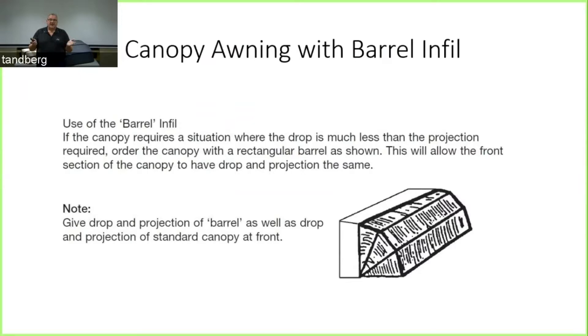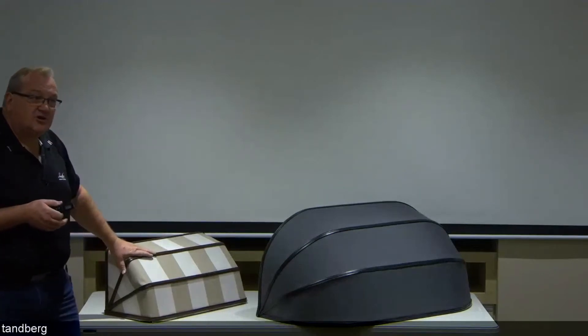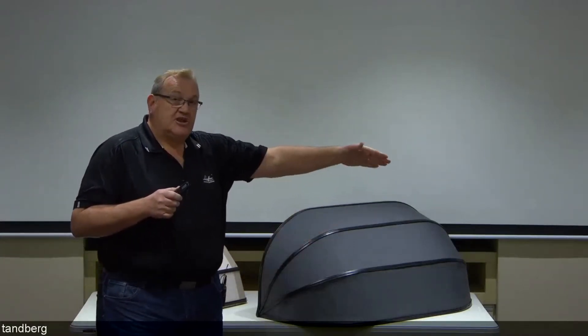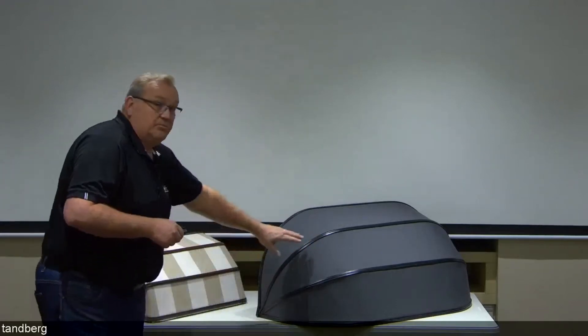For an architrave fit, give us the full width with no deductions and mount to the architrave — we'd recommend the rectangular with 10mm radius square corners, as the curved styles won't cut out light and weather as effectively. When fitting into a brick wall, you can use either the 10mm radius or the 300mm boulevard corners, but add a minimum of 300mm to the width to ensure adequate coverage over the opening.